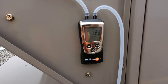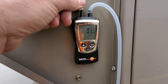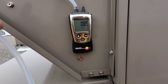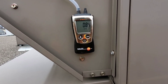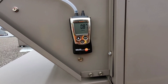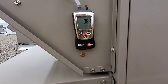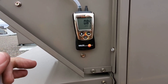If you want to see the static pressure of just the return, we pull the supply out — and there is our return static. To check the supply static pressure, we pull off the return tubing. From both readings you can see our supply static is much higher than the return static, meaning we have more restriction or resistance on the supply side. This unit's two to three years old and we haven't had any issues with it, and we are under the maximum 2.0 external static pressure. But we might have to look into this further — the ductwork might not be sized correctly, given the large differential between supply and return.